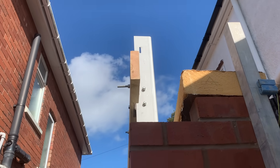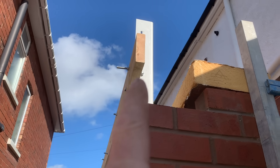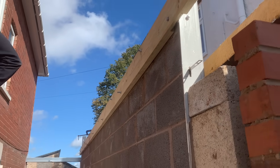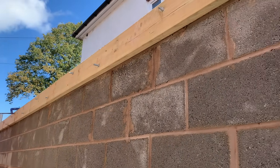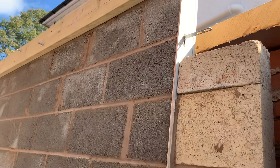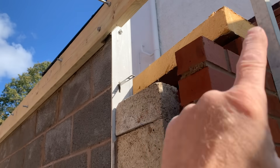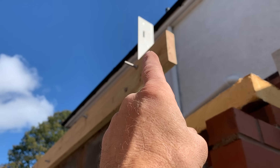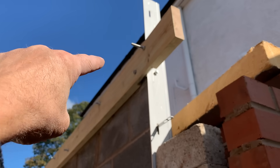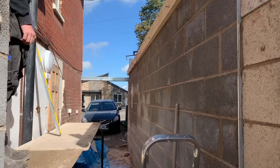Right, we've got our wind post in now and we've got the wall plate now bolted to the plates and resined in — 12 bolts at 45 centres, and bolted to the other wind post at the other end. So now that wall is solid through. I'll build this up in a minute because we've got a catnic coming across here and then return ready for a parapet wall that goes above, and the valley created here with the downpipe.